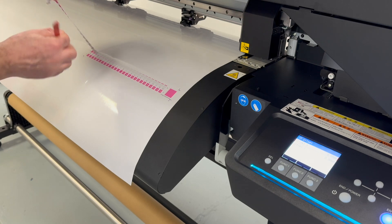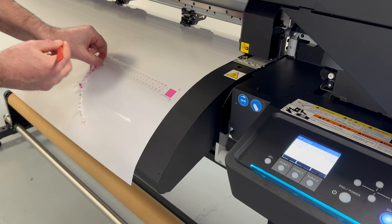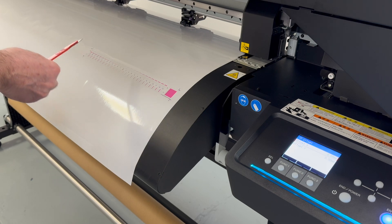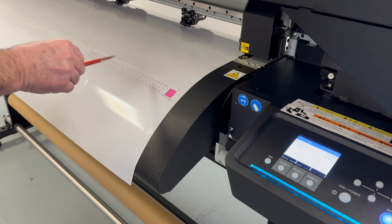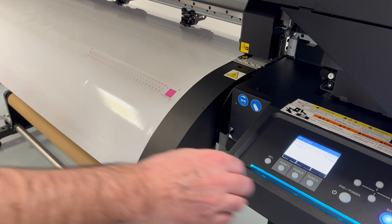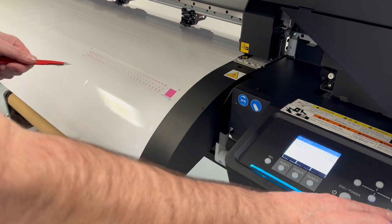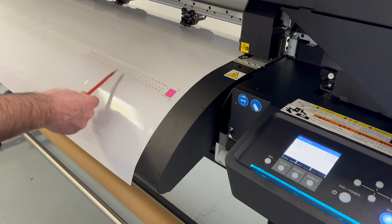You've got two adjustments: X which is your feed, and Y which is your scan. When you do this yourself you'll see quite clearly — you're looking for the most even cut and the least amount of pink showing. For the X, that is 0, so 0.00. X is quite easy, it's 0, so drop down, press enter, and then go to Y.